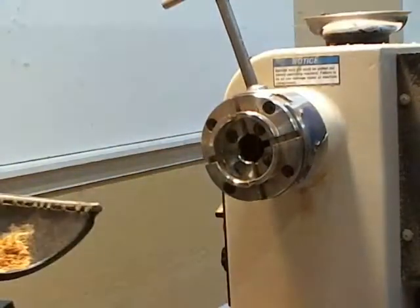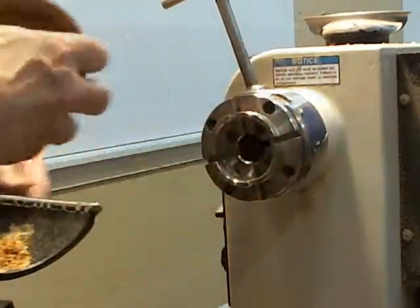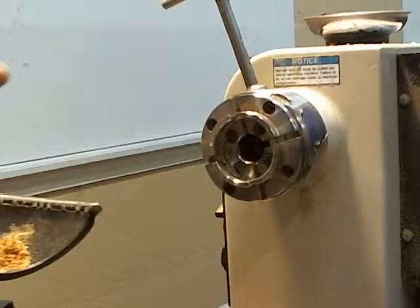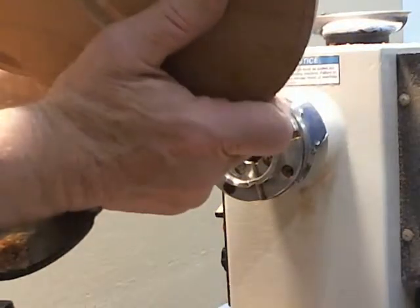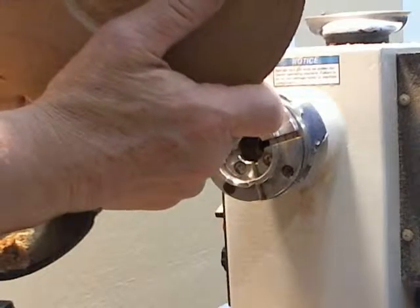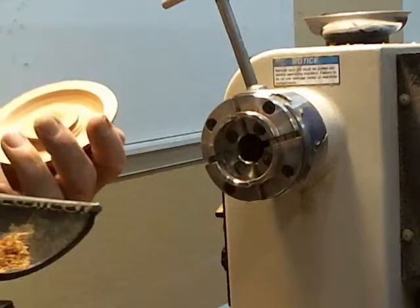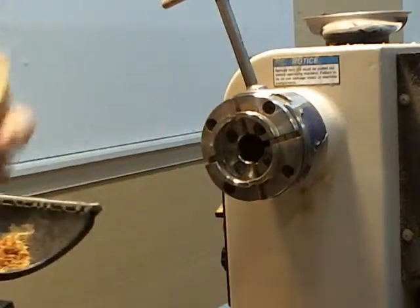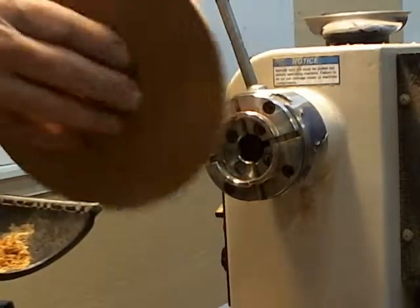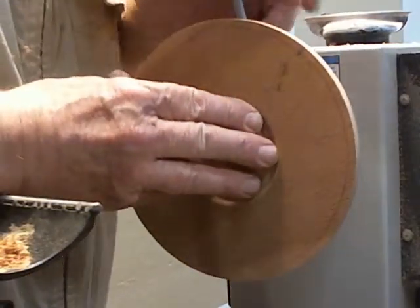That's a lot to cut. The back side of the mortise or tenon. Now, when you start turning, you do the mortise and put that in the chuck. I already cut the mortise in. It's at about 2 1/4. So if you're going to turn the front, you'll go in that mortise and catch it, once the back's all done.